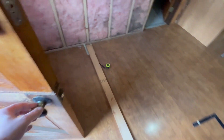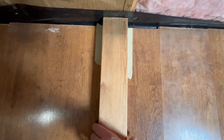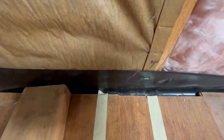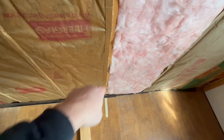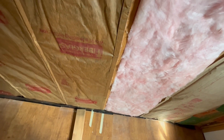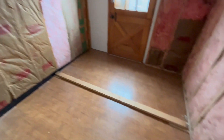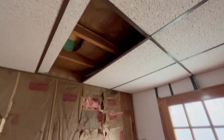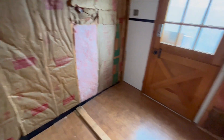There is enough room to come in and easily close the door back up. You can see where I have the marks - once I move the two-by-four, I have masking tape and marks on the wall. Later on, each stud I'll put a piece of tape at the bottom so when I do the drywall I know exactly where it's at. This is confirmed as the place where the wall will come across so I can tie into a stud on each wall.